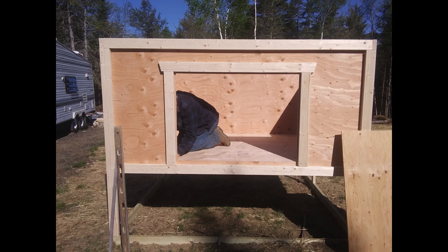You can see I'm inside on that plywood. The reason we did that is it makes it easy to change the plywood if it ever rots out from excessive moisture. I tend to not use a lot of pressure treated around the animals if I can help it. One thing Carolina Coops does is use plastic sheeting inside — you could do that, or use heavy paints, which is what we did: an oil-based, poly-based decking paint to really seal it all up inside.